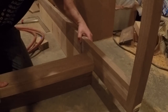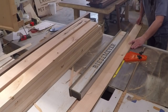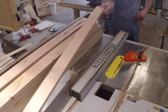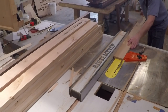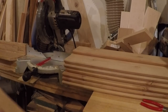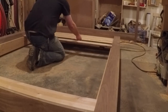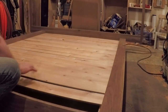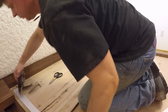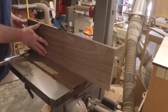Now I needed to make a platform for the mattress to sit on, so I ripped a bunch of slats to support the mattress. To reduce the shipping weight and make it so I could roll up the slats together, I beveled the sides. I cut each one to length and test fit them — I installed them the full length of the bed, since if you don't use a box spring the mattress has to be fully supported underneath or you void your warranty. I also installed a center support using the same hardware as the sides to help support the mattress slats, then stapled on some nylon strapping to keep all the slats together during shipping so they could roll up together.